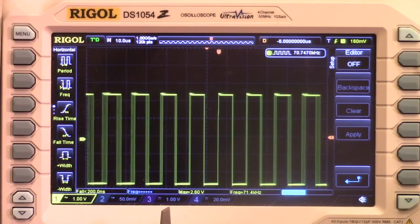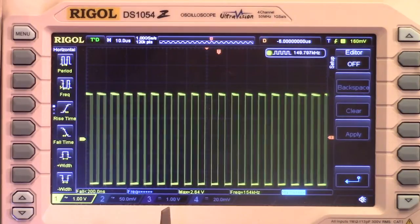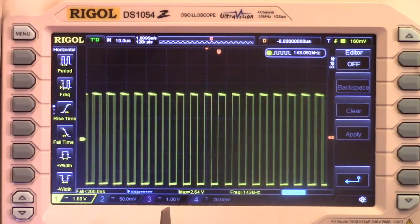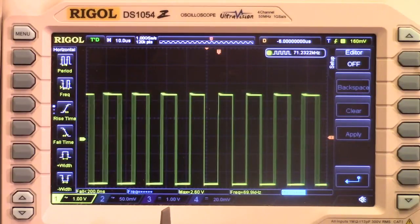You know, from 0 to 255, say, if I mapped that to just a byte, then 70 kilohertz would be the number 25 in there. And then as the morning came in and the room got brighter and brighter, up to around 200 kilohertz, that might be a value of say 100. And so I know then that the ambient light is 100, and you can do that programmatically.